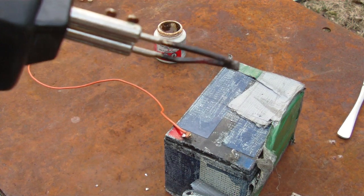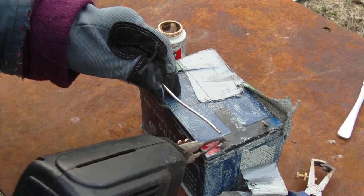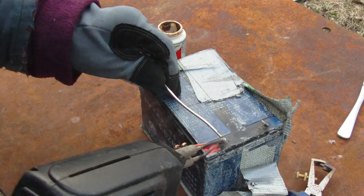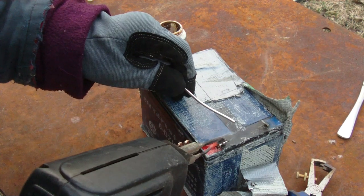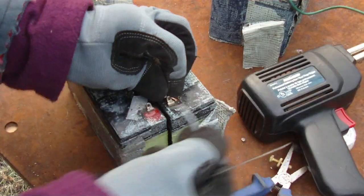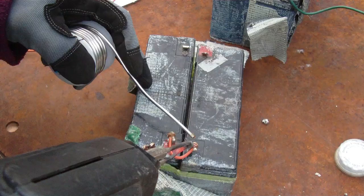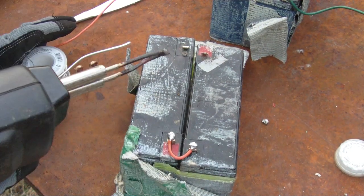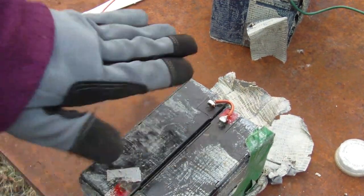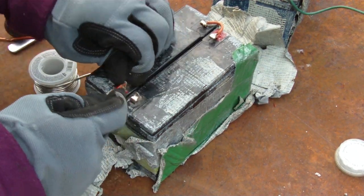150 watts. Whoever had this before and tried to solder it — their iron probably wasn't hot enough and they didn't clean it. I don't want to heat it up too much. Basically I'm going to heat it up, but we only want to get it hot enough until the solder starts to melt. You can see it's already starting to get a nice little solder on there. We can safely do this — I'll do a jumper. You can see that's a much better solder than what it was before.